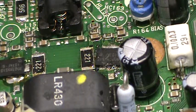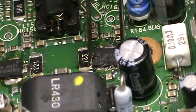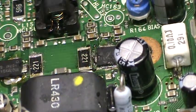It is okay for these things to reach 160, but not much more. 160 should be just below the temperature required for the solder to float, so we should be working just under it, but apparently we're not. Not too concerned about it because these chips can take quite a bit of heat, as you're seeing. Okay. There, see how it moved?